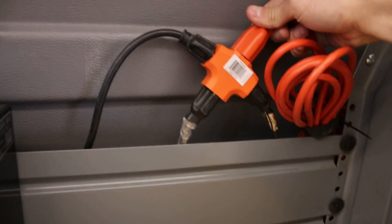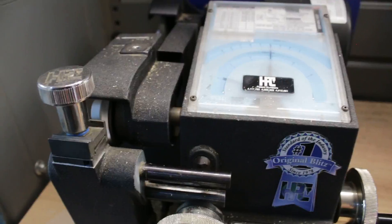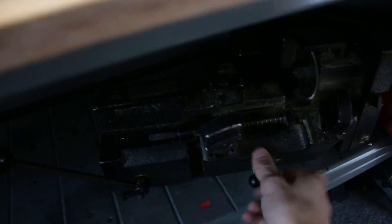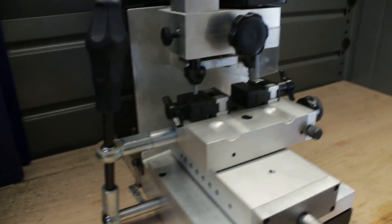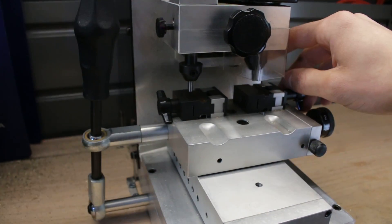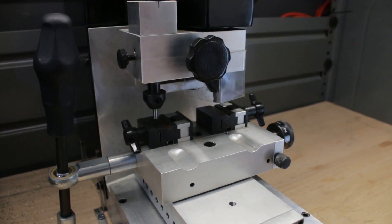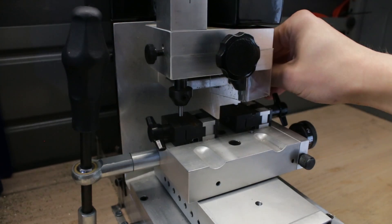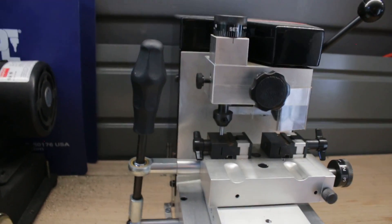My key machines connected through the extension cord all run just fine with the engine off. I just prefer to turn it on. The only machine I have trouble with occasionally is my Sidewinder 2 — when it starts up, the inverter beeps; that's the overload protection. When it's really cold it actually won't work, but in the summer I don't have any trouble with it.